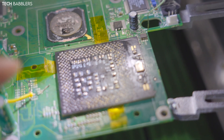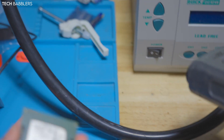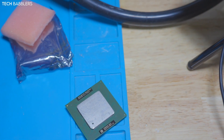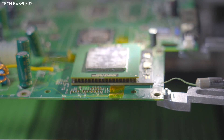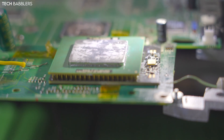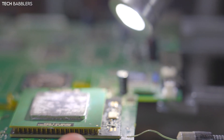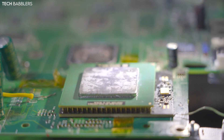From here, we need to get to this result. I'm using a 1.2 chip — that's my chip. I'm going to place it on the interposer now, then flow it back down, and hopefully it'll work. This is the final shot before flowing it. I should have it lined up properly, so that's how it's going to look. When it flows, the solder paste will take on each one of those pins. I'm going to flow it up to about 200 degrees, and hopefully it'll work.